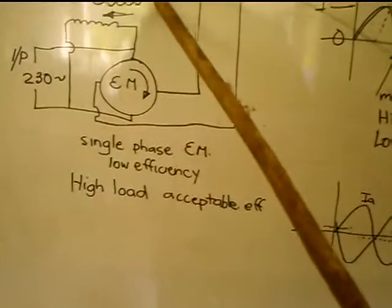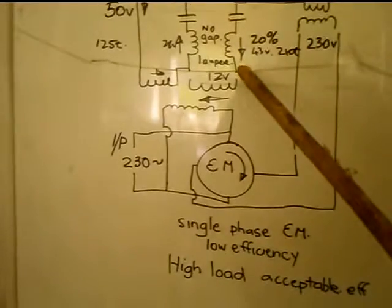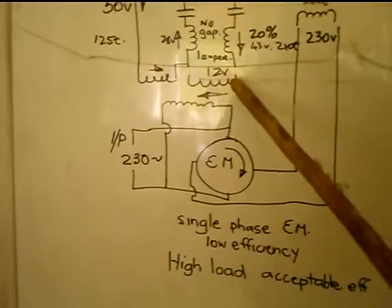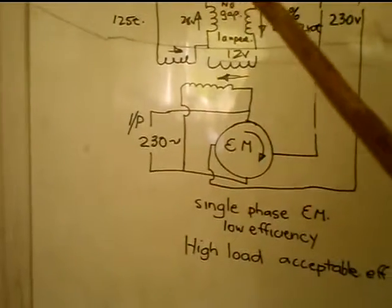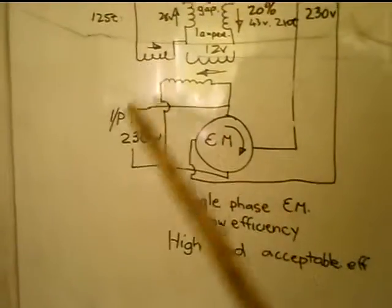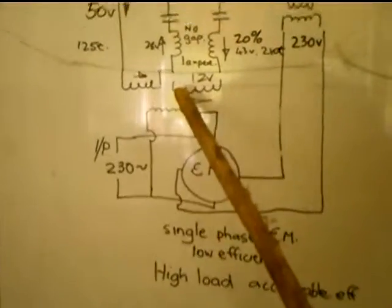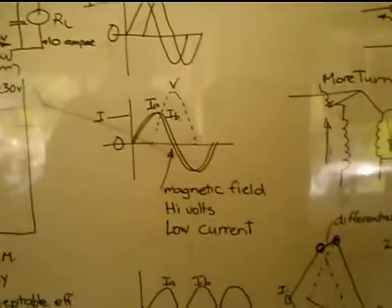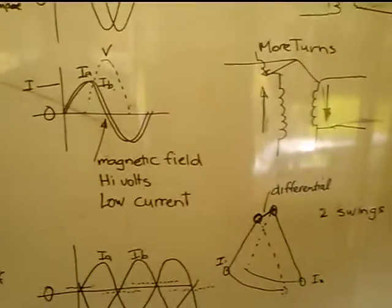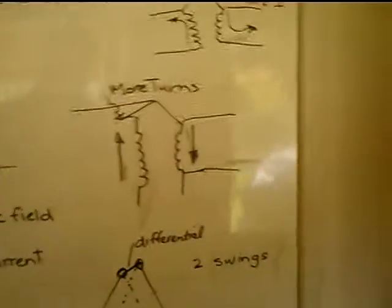This is actually quite inefficient this way, because it's through an inductor. You could actually do this solid state. You don't actually need all this. All this could go, and you could just create a 2 output inverter using the quadrature and sine cosine system. There's two ways of doing it. You could use a processor, of course, but anyhow, I've done another little bit of something here.